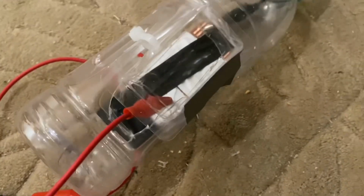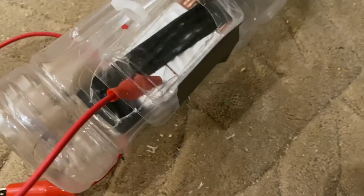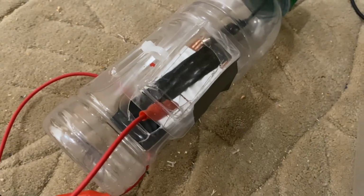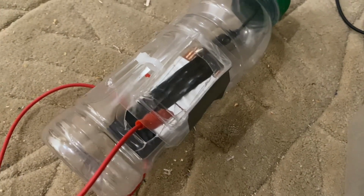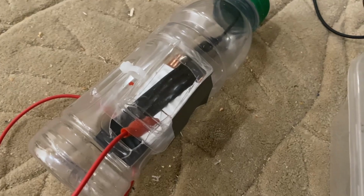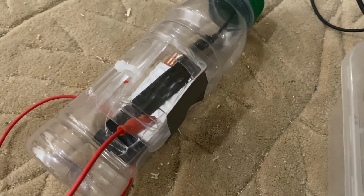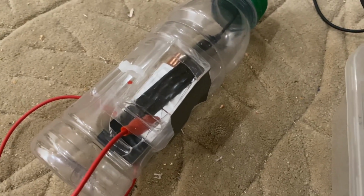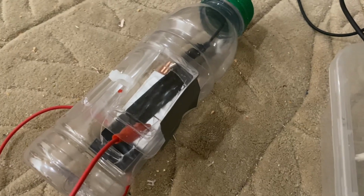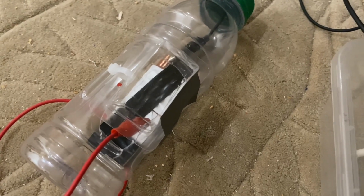I think there were like 22 resistors, something like that, on there, and if each one is rated at like 200 volts, right? That's like close to 5 kilovolt rating in total. And it's wired in series. Each one is 360 kilo ohms, I think. And then I messed up some of the resistors while wiring it together, so I just replaced 3 of them with like a 1 mega ohm resistor, which should still come out to like 9 mega ohms in total.